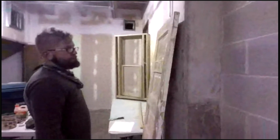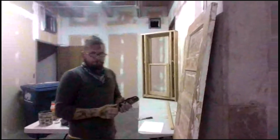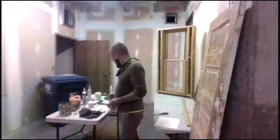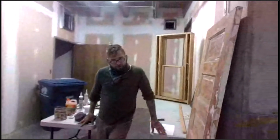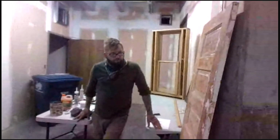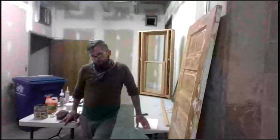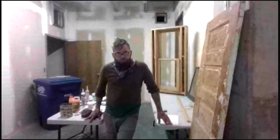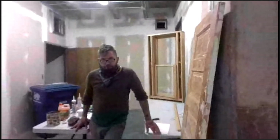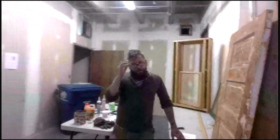Right, and I know you probably are tired of hearing about it, but if it is a friction surface, if there is paint on the door and on the jamb or the frame around the door, when it rubs together, it could be generating lead dust. Yeah. So you want to make sure that your doors open and close easily without any rubbing to prevent any sort of lead dust that may go into the air or onto the ground because it is a heavy mineral. So you want your doors to open and close for a happy quality of life, but also for health and safety.